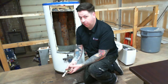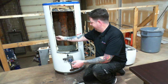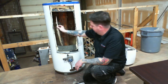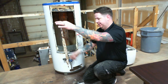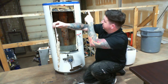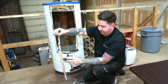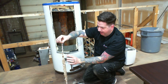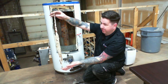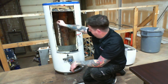The reason there are so many minerals clogged up in here — looking like lava, just breaking off in your hand — is because the anode rod did its job, broke down, and fell apart. This rod is three-quarter inches in diameter, about the same as the top of your hot water tank. It's made from aluminum or zinc depending on the model, and it's supposed to collect all the hardness in the water. You can see all the calcium buildup. Once it hits a certain breaking point, it stops collecting, starts corroding, and falls apart.